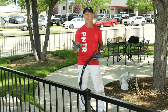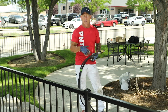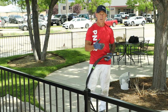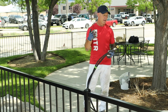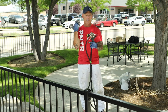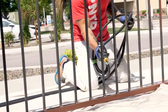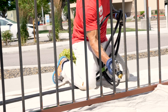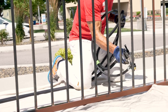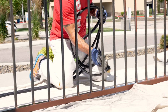So if you wanted to decrease the dry time, that would be a possibility too, by adding acetone to help it dry faster. But I started spraying without thinning. I'm using the Apollo Atomizer 7700 gun, using the HS cap and the 1.3 needle size HSB cap, and that's working perfectly without thinning it.